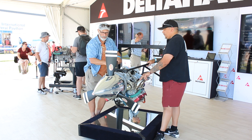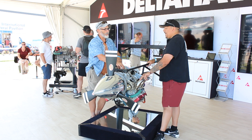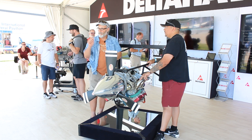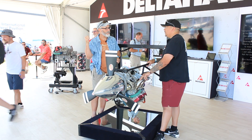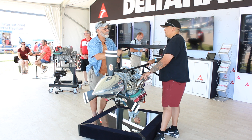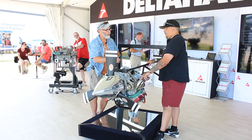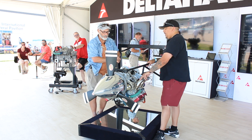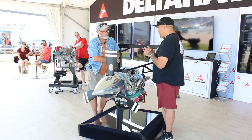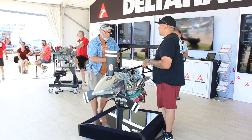This is kind of the latest generation. The one generation before this that you guys did the certification work on is going on my RV-14, which is parked over there — we'll do the flight testing. In the background we're building a second RV-14, and we'll be getting that dialed in as we're flying the first one. Could you walk through a couple of things you did on this Gen 2 versus that one? In the casting alone you can kind of see the difference. We did go with someone else for that casting, and we've taken a lot of weight out of it — the block alone, they took about 19 pounds out of it.